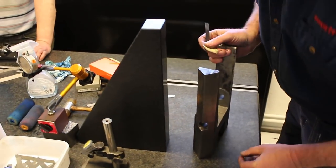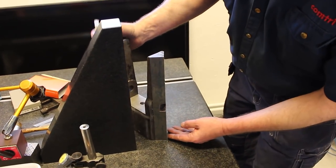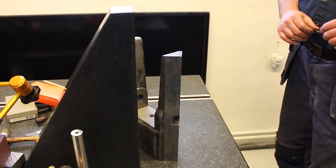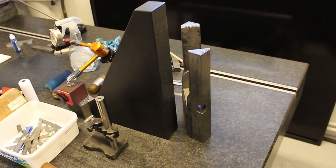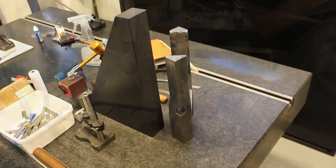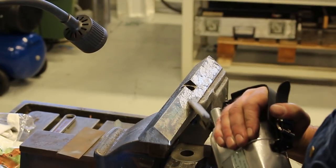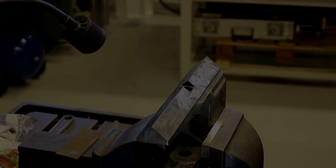This is the ram of the deep draw punch press Thorsten brought with him. They machined the bottom surface square on a milling machine so they could measure and compare the squareness against the granite angle on the surface plate. Here he is roughing down prismatic ways. And then we got a lesson from Richard in measuring and aligning prismatic ways.